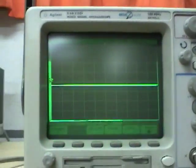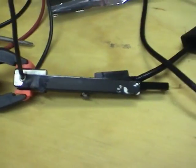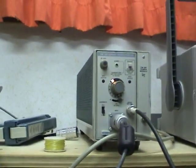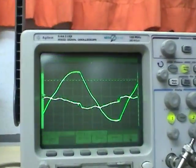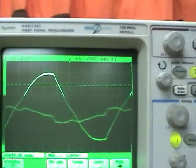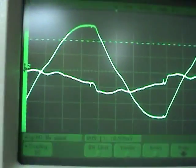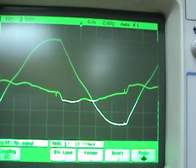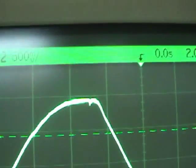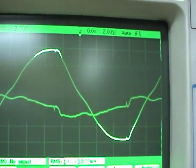Let's just run a current through it and see what it's actually measuring. I've got this measuring heater current. Also got the good current probe measuring the actual current. The good waveform — that one, turning on and off — is the real current. And the other one is the output of the broken probe. It looks like it's picking up some of the high frequencies — that little blip is being picked up correctly — but the other part of the waveform is sort of reversed.